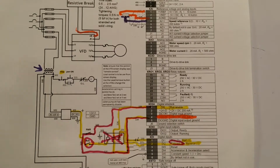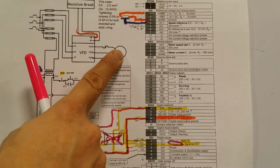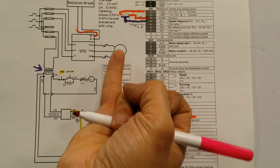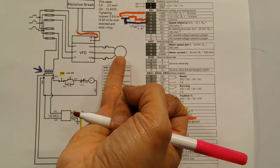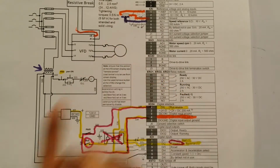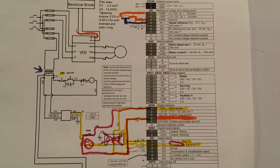After I did all of these, the only thing that I needed to do was just to reprogram the settings and the machine itself using the parameters of the motor. I had to find out the actual frequency, speed of the motor for 60 hertz, which according to a label plate, I really used the label plate to get a lot of information like amperage, voltage, RPMs, and horsepower. And I had to input all that information via the screen.